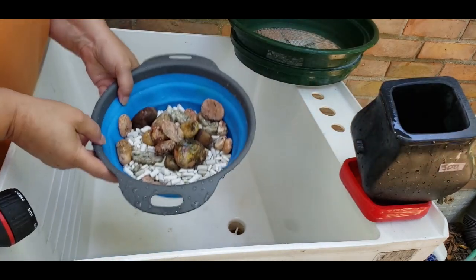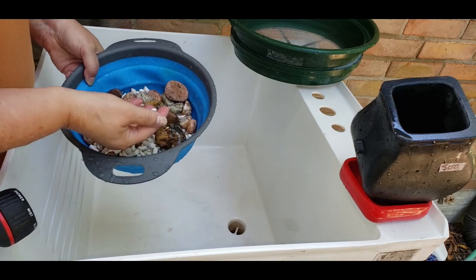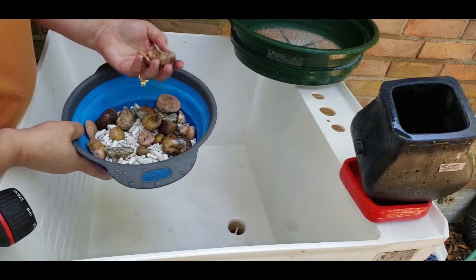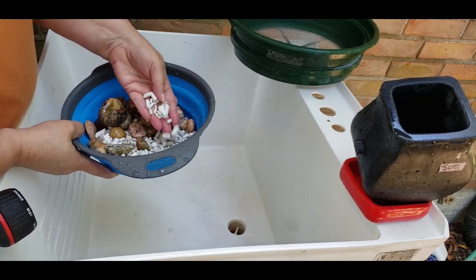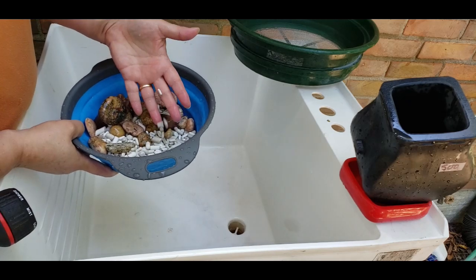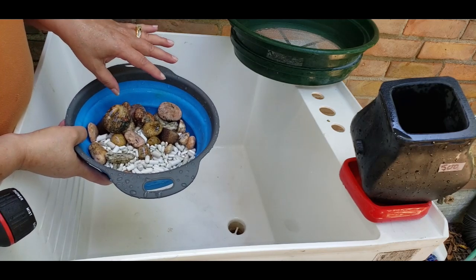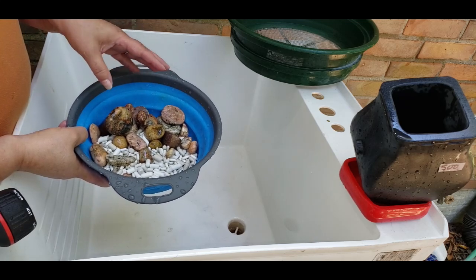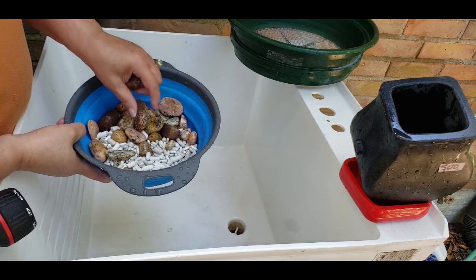Now this ceramic media is going to be kept for 500. I'm going to let it air dry and then put it away till the next time I need it. I have a different set of this media that I only use in the 1000 stage. So I keep my barrels separate, I keep my ceramic media separate, and I'm getting better results because I'm not having the possibility of any cross-contamination. So it's a fun little experiment.